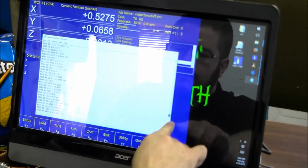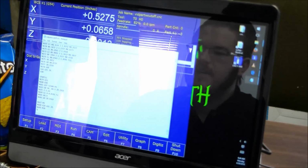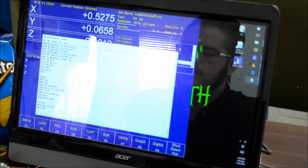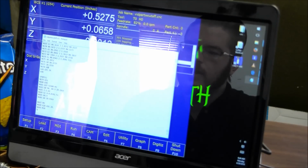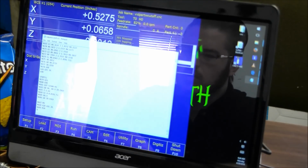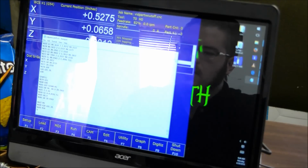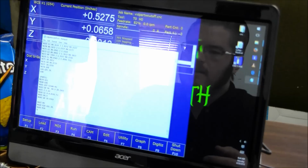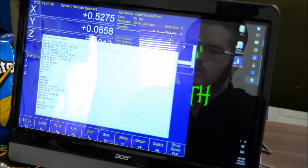Now we go down here, and one thing that I do and that I strongly recommend is after each turning tool job, reinsert that G28, G91, Z0, and then G90. What that will do is after it uses one tool, before going to the next coordinate with the second tool, it will raise that spindle up and out of the way. You do not want it to cross over to the other work coordinate system without having enough clearance to do so. That could end very badly.